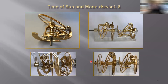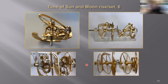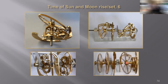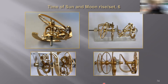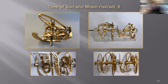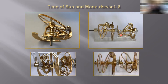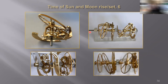Here we go. So here you'll see as he's putting it in fast forward, you'll start to see how this wheel begins to slide along the stirrup, and he'll stop it for a moment, and you'll see where the wheel is in relationship to the stirrup, and it slides across that opening, this little slide here. You'll see this wheel actually does move back and forth along that stirrup on the inside. And that then varies the rotation of that differential. And then one differential is fed into the other, and then you have your output here.